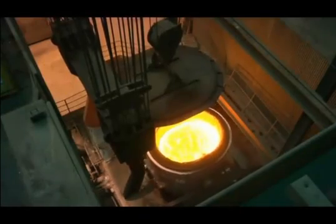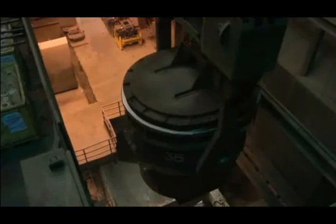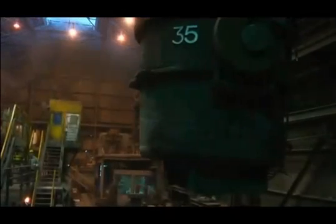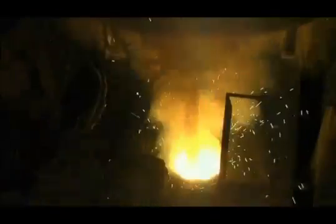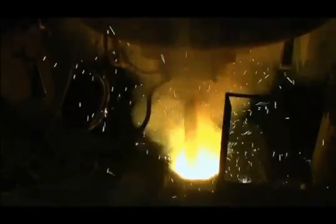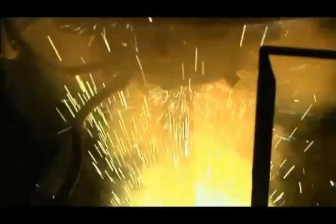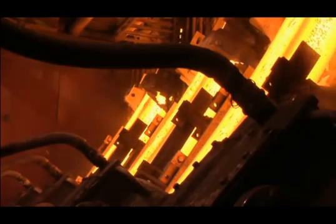At the Harrison Steel Plant, we cast steel blooms in our strand caster, designed to produce extremely clean bar products. A ladle of steel is lifted 5 stories up, protected from unwanted gases in the atmosphere by a shroud of argon gas. The steel is carefully metered out into a large tub called a tundish. From there, it flows down into 4 rectangular water-cooled molds, electromagnetically stirred as the steel moves.